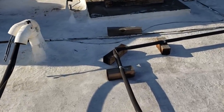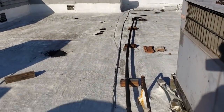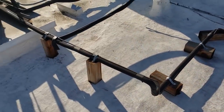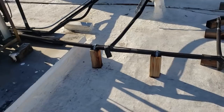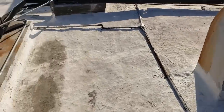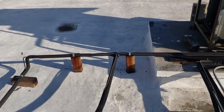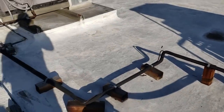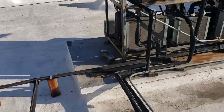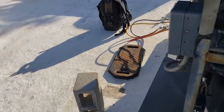This is where I went to change a coil and then found an underground line set leak and had to run a new line set. It isn't my best work, but I explained it in the other video — it's what the customer could afford. It still works. Things don't have to be absolutely perfect. If I'd done it differently, I'd have run it on Unistrut, used strut clamps, made it straight. But it was just a quick slam dunk job, that's all they wanted. Can't always be perfect, but anyways, back to the job at hand.